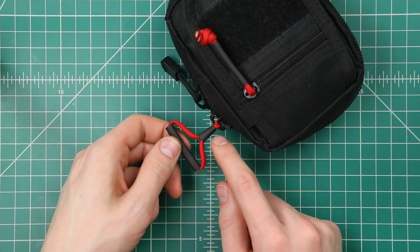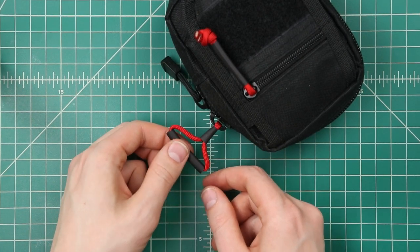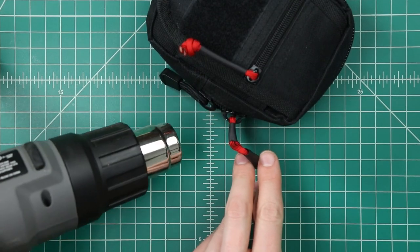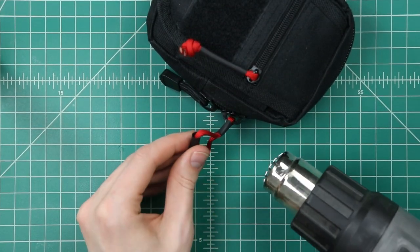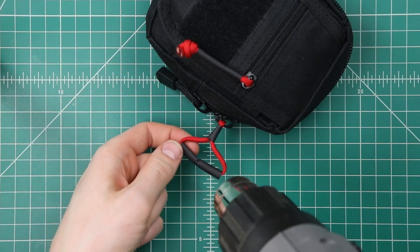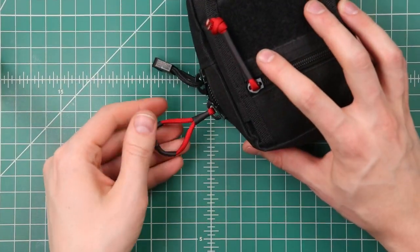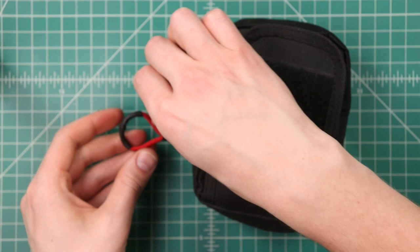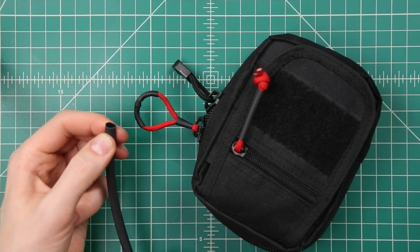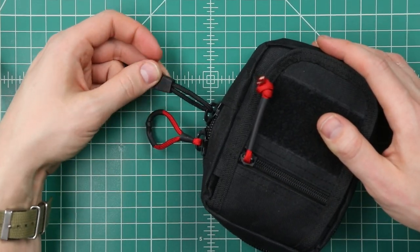Now we can start shrinking our tubing down to size. We'll start with this one after you're sure that your meld mark is in the middle of the loop end. I'm going to do this on low so I don't hurt my fingers as I'm kind of bending that into shape. As that's still cooling you can kind of mold that into shape a little more too. You can see our meld mark through there — again if you want to avoid that you can use the adhesive lined stuff, and we'll cover that in our next video too. We'll make one more of these just to make everything match, then we'll show you the final product.